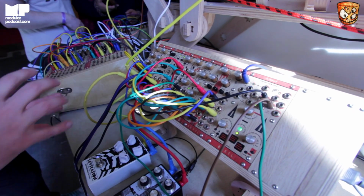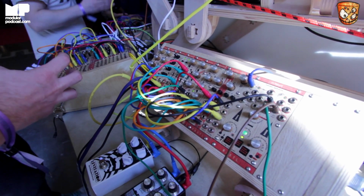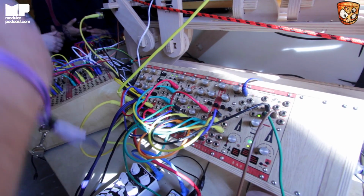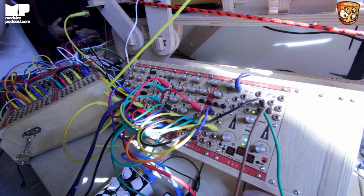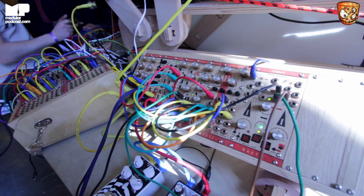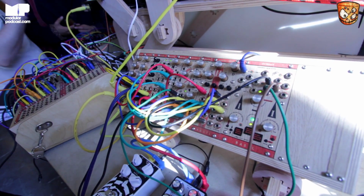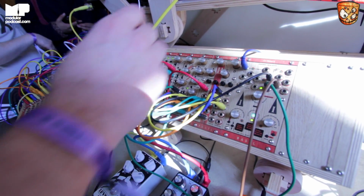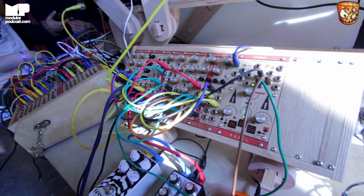Right. So you can have a different waveform of the modulated VCO going there, or you can make through zero modulation on a filter, or you can invert the phase. Basically, you can decide what's happening in this through zero modulation. Yeah. So it really is what you want it to be. Lots of utilities that combine together. Yeah.